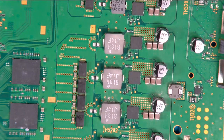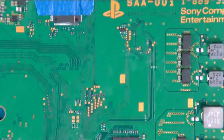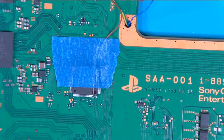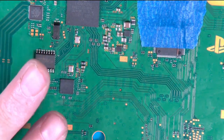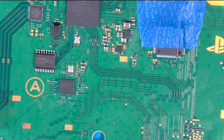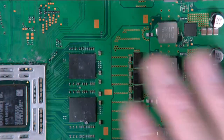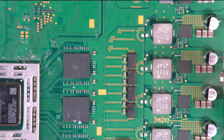Right, okay, so what have we done? We've looked at a board. I've showed you how to lift the pin off the Syscon on the 100 pin, which is, this is on the FAT. This is probably the easiest board to start on, namely also because the NOR is a SOIC, and it's a lot easier to connect to and read. That'd be the next little video I should do, how to connect and read a SOIC. But you should know now how to read the Syscon, and all the tools are free and available to you. The only thing you've got to buy is your teensy and any tools if you haven't got any tools.